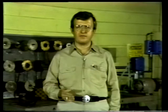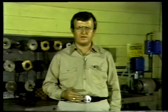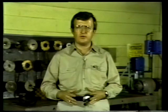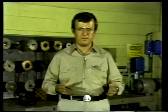When a filler metal is required, it can be applied in three ways. A filler rod can be held by the welder, or filler metal can be fed in automatically from a roll or spool. A third method of applying filler for the weld is to place consumable metal filler into the joint before the welding is begun. In any case, the metal must be compatible with the metal of the surfaces to be welded.